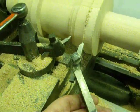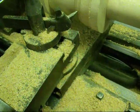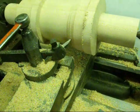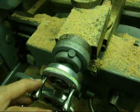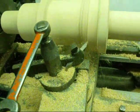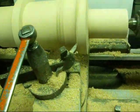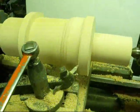I've switched tool holders and tools — the one in my hand is the one I've been using, but now I have a left-hand turning tool in the holder; actually it's a facing tool. This is one of the few times in your entire life you'll use a tool holder like this, but they come in handy occasionally so don't throw it away. We're just going to complete the turning going toward the tailstock and up to this shoulder. I've also turned the compound five degrees on the other side of zero. I've moved the carriage stop over to this side — not the best setup but we just have a few more passes and then we're done.